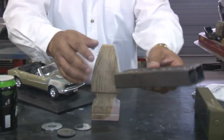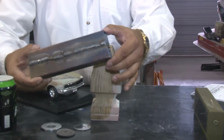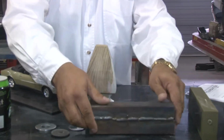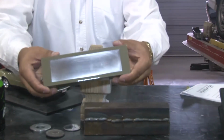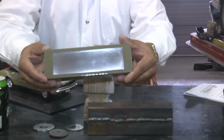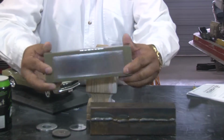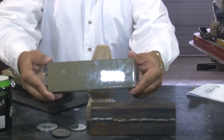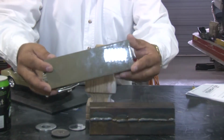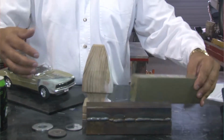This next project will take two square pieces of stock and weld them together. Not only do they practice their welding on it, but then they have to take it and work the metal, and this is a finished product, polish it and make it look like it was one piece and never welded. We then go on to use it as a second project during our painting semester to teach them how to refinish it and get it to a high deliverable gloss.